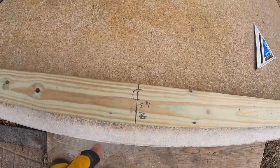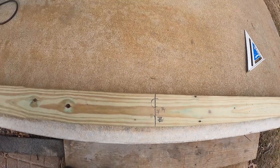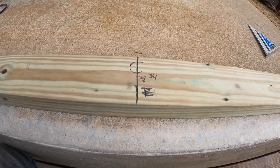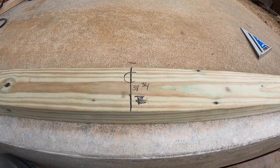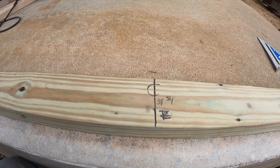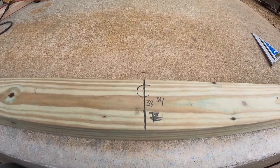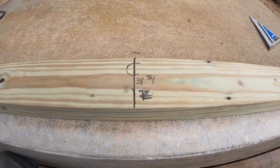My window is 60 1/4 inches wide from the flange to the flange. So I added an extra 1/2 inch to give me 60 3/4, so that I have about 1/4 inch of play on each side. These are new construction windows, so I want the nailing flange. I need to make sure the nail holes will hit wood. So that's what my tentative plans are.